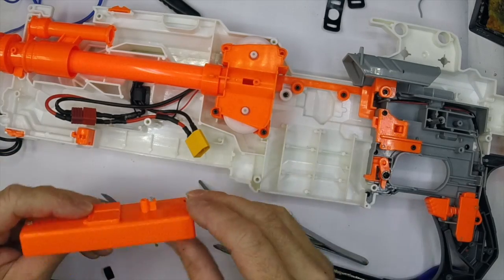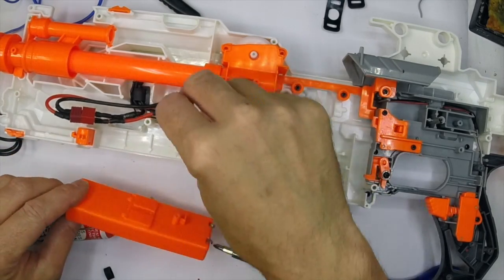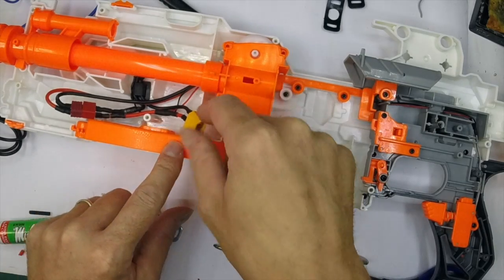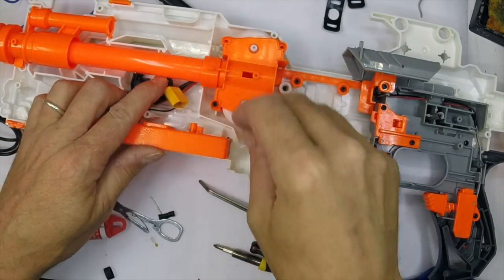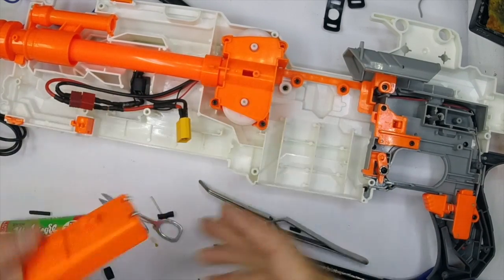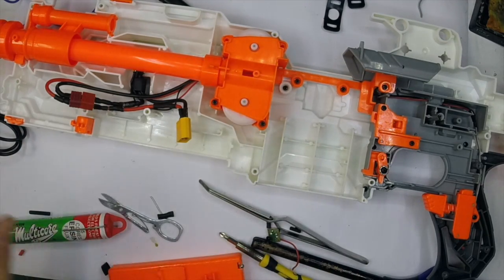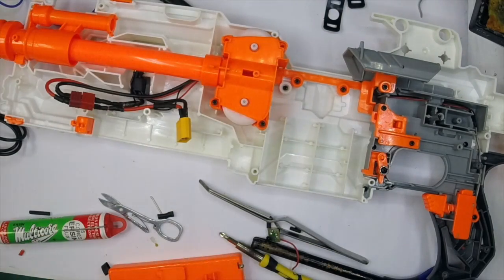What we're going to do is have the switch come up here, and we'll be able to put the battery compartment back here. There'll be a wire up here and that plug will sit up there - a nice XT60 connector inside which you'll be able to pull down to put a LiPo in. You'll also be able to use the standard batteries. I'm going to clip off this little nub on the back here just to allow me a little bit more room.